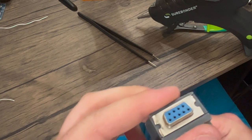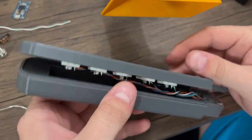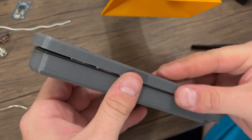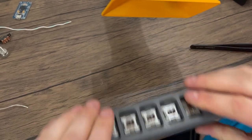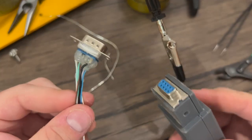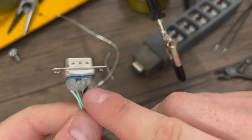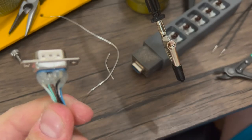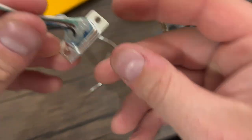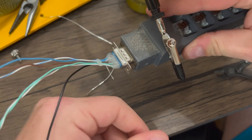After you've built the neck and got everything put together, I like to run a bead of super glue down the seam, close it up, and set some books on top to weigh it down — that'll let everything weld together without any cracks. So after you've got your neck built up, you're going to wire the female side of the cable. It's basically the same thing — the wire colors don't really matter, you just want to make sure you're putting the same wires in. On the five-pin side, five wires go to it, and on the bottom left of this one we have the black ground cable — because if we put it on the bottom right here it's going to be mirrored, so when this plugs in you have one-to-one connections.